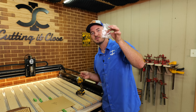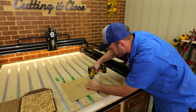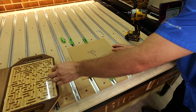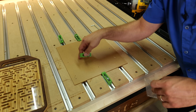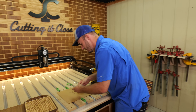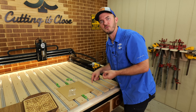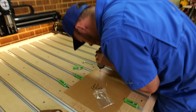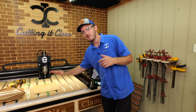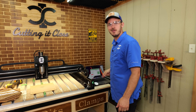After we drill the holes, use the screws that came with the kit to hold down that acrylic. You definitely do not have to do this — you can use double-sided tape or clamps. I'm just trying to give you different ideas to have really secure hold-down. So I'm going to put in all the screws, and then we'll do the outside profile on the acrylic. Got it screwed down. Let's cut out this acrylic — let me show you what it looks like on the digital file, then we'll hit go.